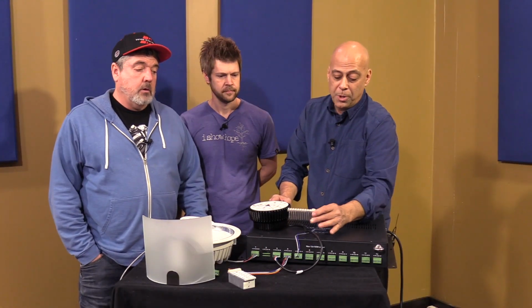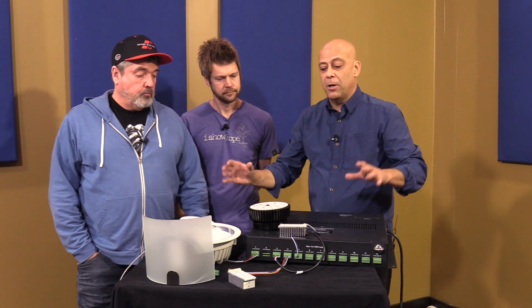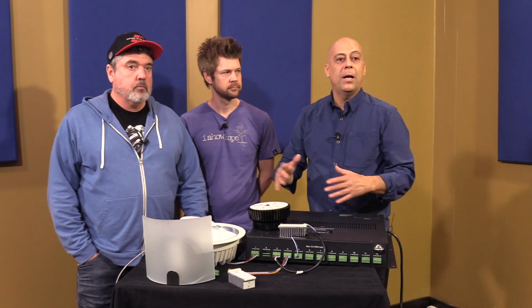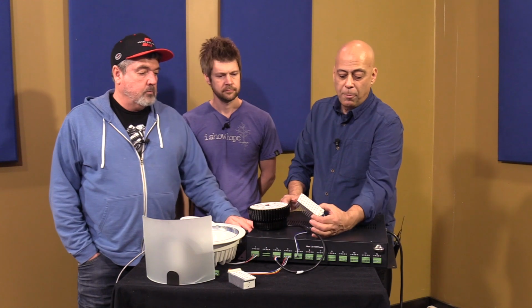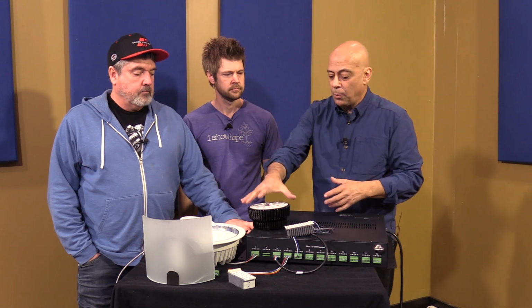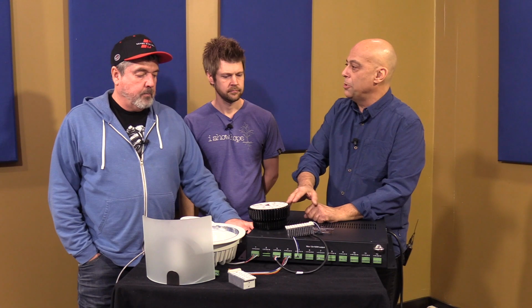So at the school, what we're doing is we're modifying some chandeliers within the center area. We're using the 50 watters in all the classrooms. We're putting 12 per classroom, extremely bright, what you would expect from a classroom. We are putting these on these fake beams we're putting across to uplight the ceiling, and then we're retrofitting the chandeliers with our 30-watt modules.